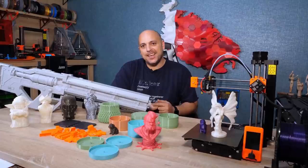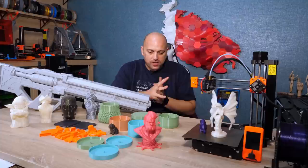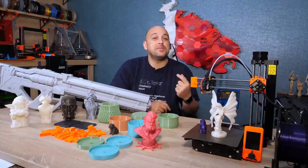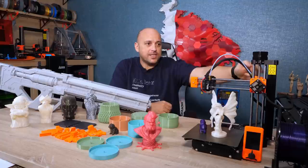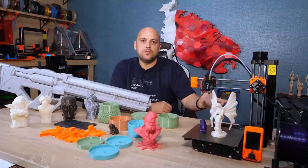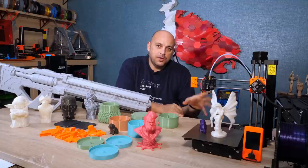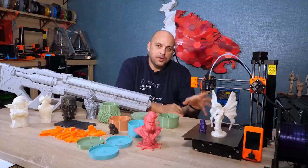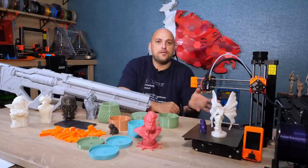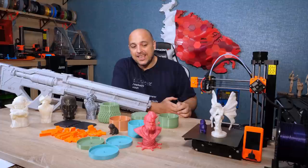Now you're probably wondering — am I going to say anything against this machine? The answer is no, not anymore. When I say 'not anymore,' it's because there was something that used to bug me: it basically had to do with loading the filament. Once you load the filament, if you miss the gears on the extruder and it doesn't push it all the way through, you only get one option to push the filament a little bit further — like a few centimeters — and then the screen just goes to the home screen. That is fixed now; you can keep on pushing or restart over. That's the thing with this new 32-bit board — this is kind of a test benchmark of how far it can push features and how things can be fixed. The same 32-bit board will probably be used on the Prusa XL and their tool-changing capabilities, so I'm extremely excited for that to come out.